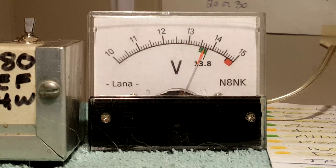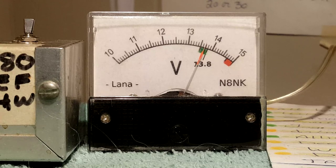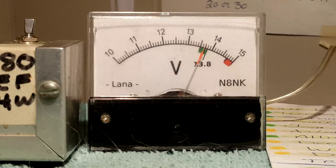Right now we are connected to the dummy load. We're on the 20 meter band, set for 100 watts. This rig draws different amounts of current on different bands — I did some testing back in the day after I got the rig, and typically it draws around 17 amps; that's the figure I'm going to use for the following examples. So I'm going to key down, and the voltage drop you see is not from the power supply — when I put a voltmeter on the power supply output terminals, it drops only one tenth of a volt under full power with this rig.